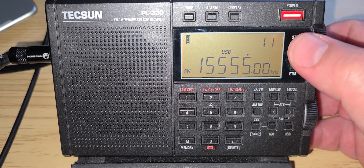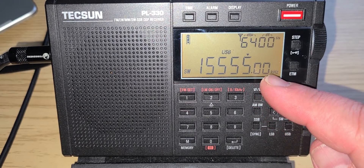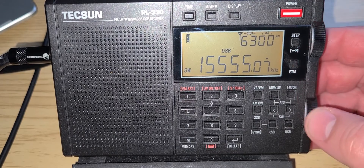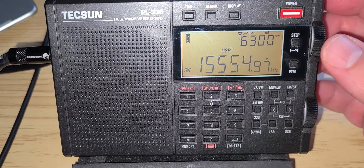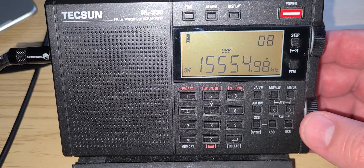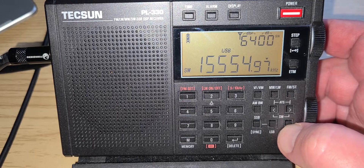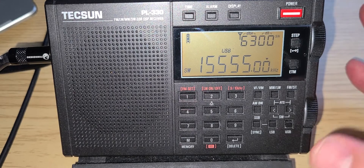You can fine-tune using the step button. You'll notice that in sideband mode the radio shows double digits on the display. When you press the step button and get to the last digit, you can fine-tune on that last digit. Depending on how off the USB voice sounds, you're able to do this. And when you've zeroed in, you can also press and hold the USB button to have it calibrate — it will flash on the display to show that it has calibrated the frequency, making it more precise.